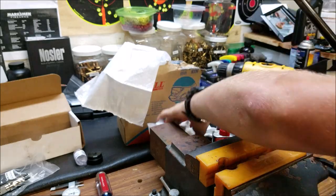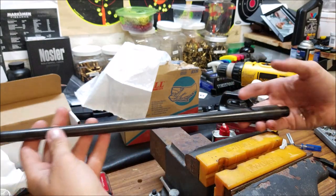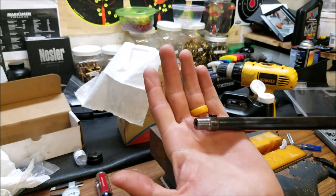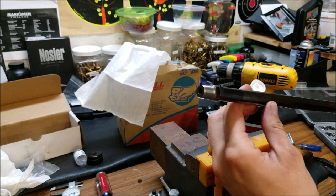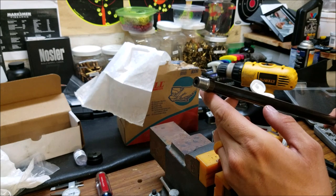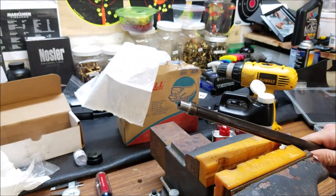One of the biggest things people worry about is cutting the barrel and getting it true — facing the barrel. By using the annular cutter, we did not even have to face the barrel. We were able to use the original barrel face and put some threads on it. I'm going to go ahead and put this rifle back together and take it out and shoot it tomorrow or Wednesday. If you have any questions about anything you saw in the video or want more explanation, feel free to post in the comments or check me out on Facebook. Thanks for watching.